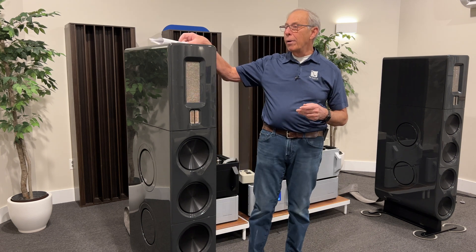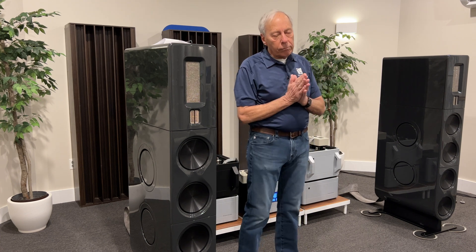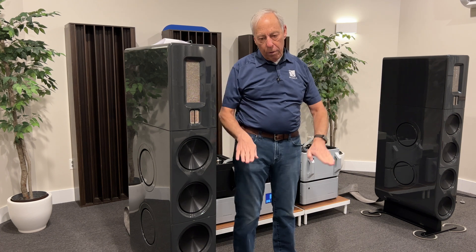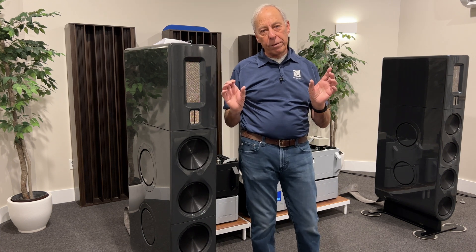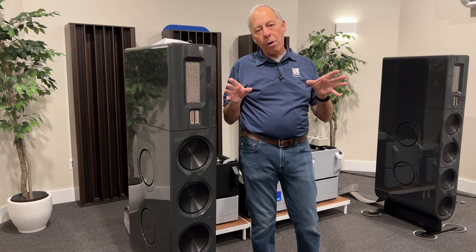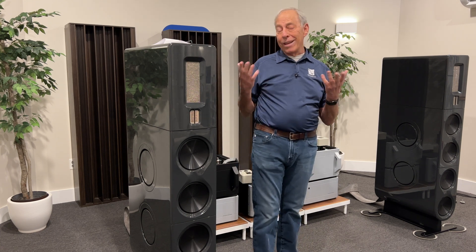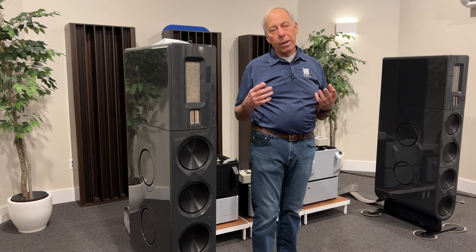Absolutely, oh yeah. And people do that all the time. So here would be the chain: if you take a high quality pair of microphones and space them apart far enough, they go into microphone preamplifiers that take the output of the microphones and raise it up. Then we go into an analog to digital converter, and inside that converter, if we're doing DSD, there is what's called an SDM — a sigma delta modulator — and that's where the magic happens.